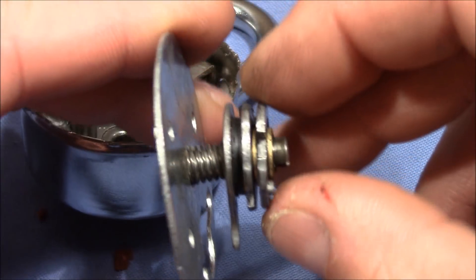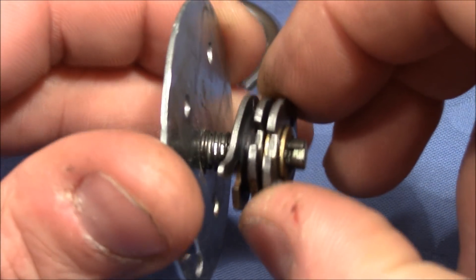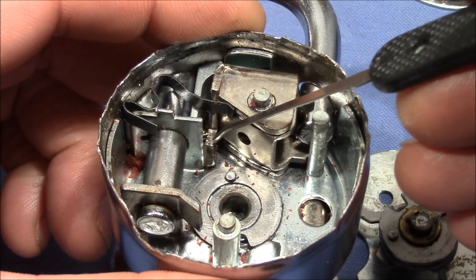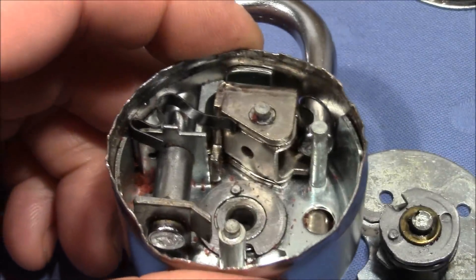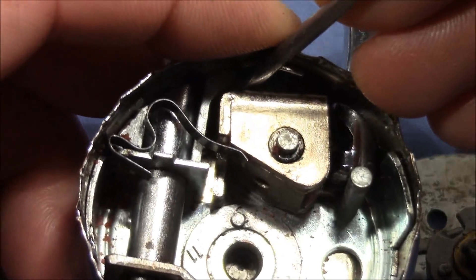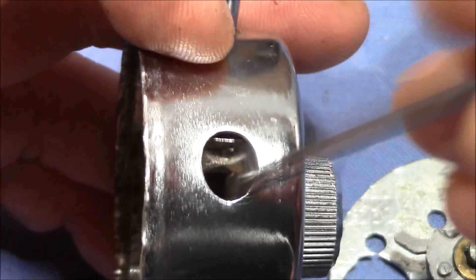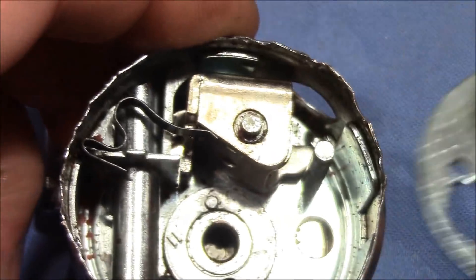That's the way you change the positions of the wheels, and these wheels have gates. If all gates are aligned properly, then this piece here can be pushed in by pulling on the shackle. So that's the usual way this works: you pull on the shackle, this piece here gets pushed down against the spring tension, and then it clears the room for the shackle to come out. So why does this not work anymore?